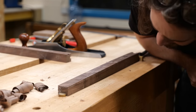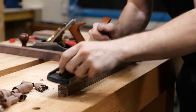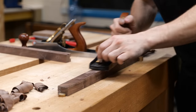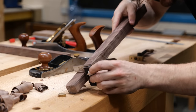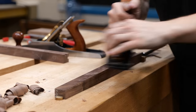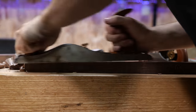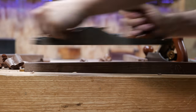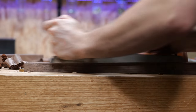I'm going to keep working down this leg. I can see that I'm approaching the line slightly quicker here than down here, so I'll just do a few short shavings again to even that out, gradually elongate them, check again — and we're looking parallel. Taking it out to check for square — looking good. So just checking, I can see there's still more waste down here than up here, so I'll give this a bit more, elongate the shavings once done, check the progress — it's looking even again. We'll continue with full length shavings.